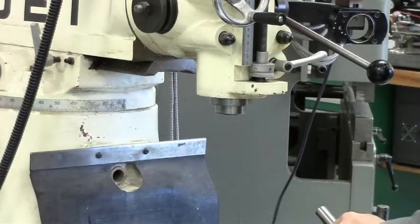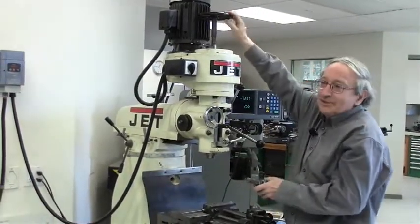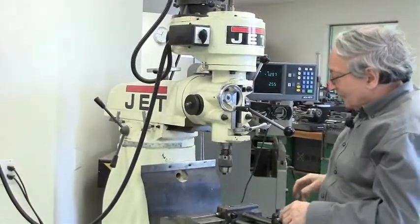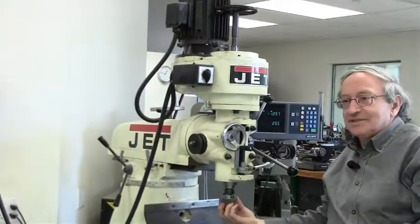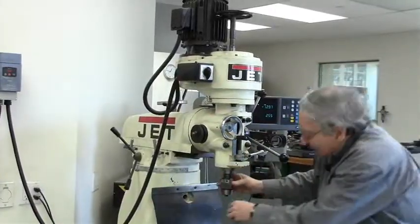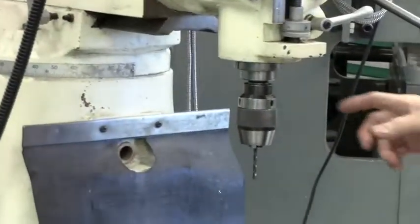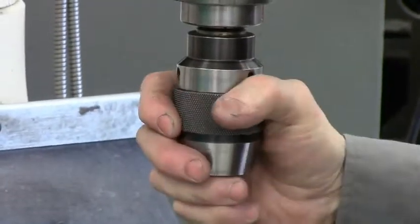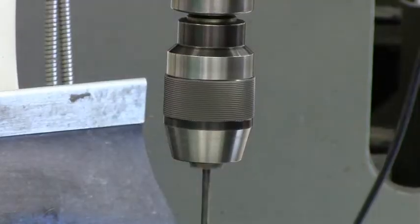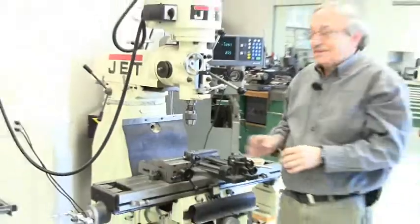You add a wheel on top so you don't need to look for wrenches — you just lock it and you're done. You want a keyless chuck like this, not a keyed chuck, because with a keyed chuck you always have to look for the key. These chucks are also more accurate. These chucks are self-tightening, so even if you didn't tighten them fully, as it drills it will tighten itself. You just do this, it's locked — that's all. You drill, and when you finish drilling, you just release it and take the drill out. It saves a lot of time.